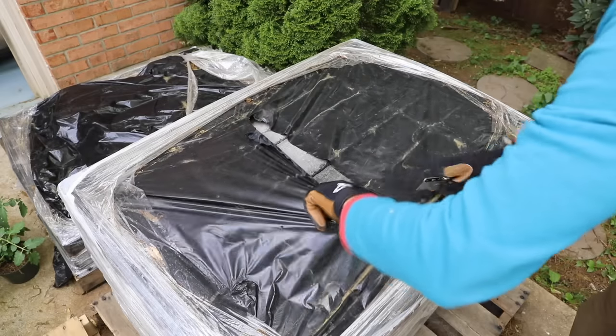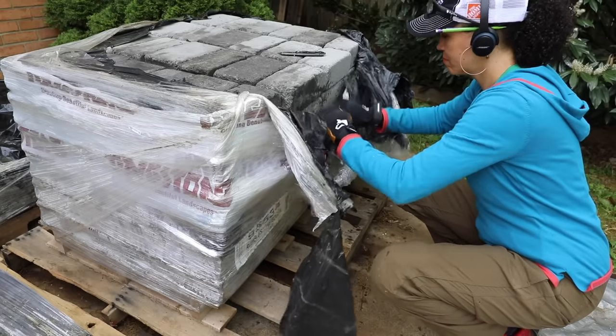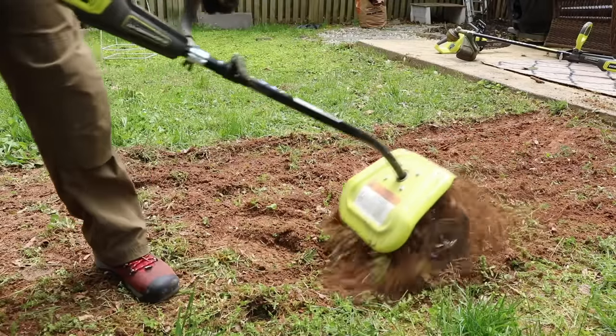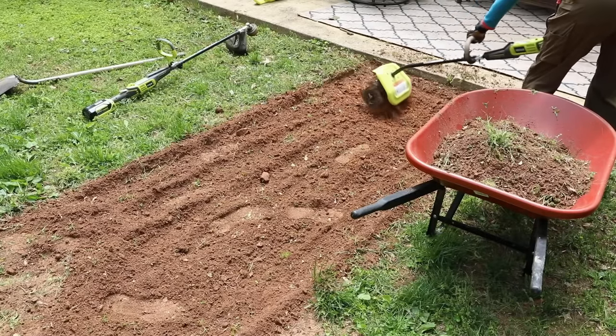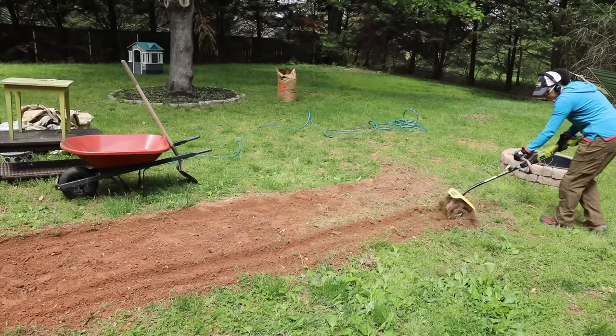The edgers I was using were by Pave Stone — Home Depot delivered them right into my driveway. They were a little thicker than what I realized when I saw them online. With them being five inches tall, I knew I was gonna have to cultivate and dig probably about two and a half to three inches down, which meant I was gonna be spending a lot of time cultivating and digging. So keep that in mind — the size of your pavers will determine how much soil you're gonna have to remove.